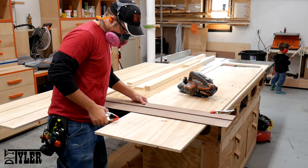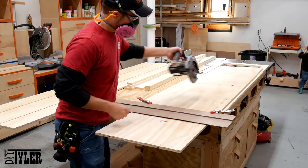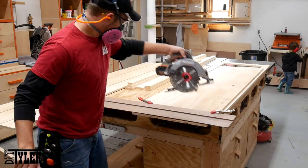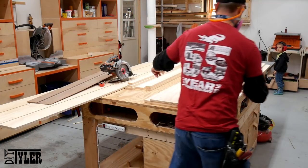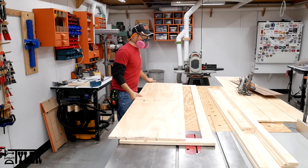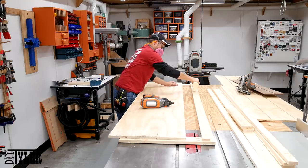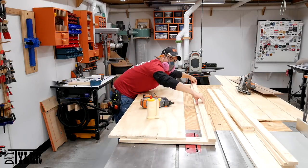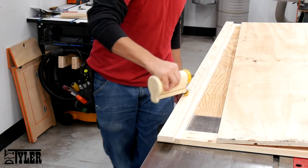The full eight foot of the T111 is longer than I needed for my particular barn doors, so I used a door board and my Ridgid cordless circular saw to cut them down to the proper length. Now I am laminating a strip of solid pine on either side of each of the doors, which will frame in the T111 and give me a full one and a half inches of solid wood to attach and hang the hardware from.